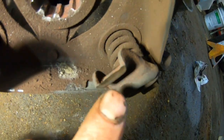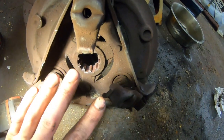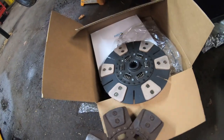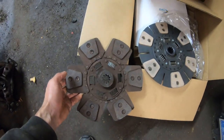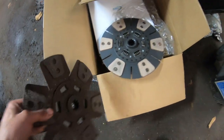This tractor was missing the clutch spring, so what that was doing was the throw-out bearing was touching this thing all the time. I really dislike walking away from a project and coming back to it weeks later and trying to figure out where you left off. So anyways, pretty obvious, I left off with the clutch. It's just the little things though.